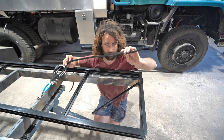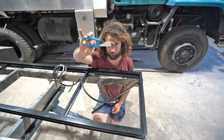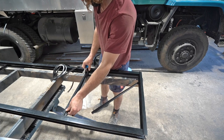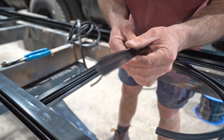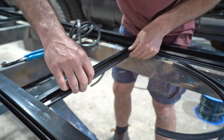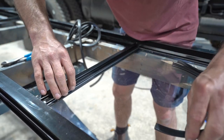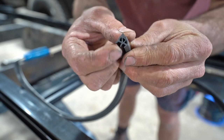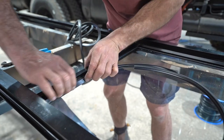You click this rubber down inside the bead. This doesn't come cut to length — you've got to buy it and cut it to length, and you can just cut it with a set of side cutters. These beads or clips have got their own little profile so they can only go in one way. You've got to lean them over a little bit and then kind of lift them up so they click in. Then you get the rubber, which also has its own profile — it only goes one way, with those two bits down — and you just push that rubber in there.